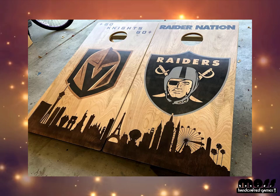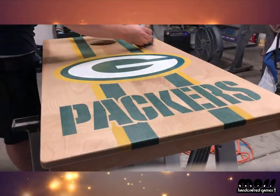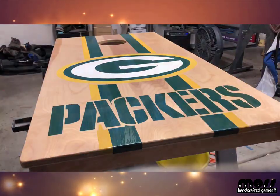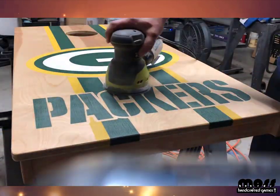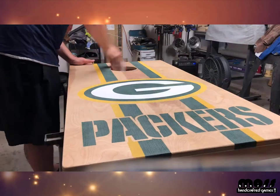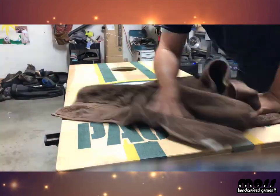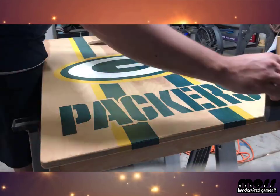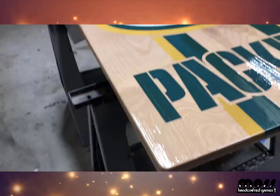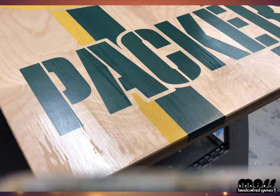Here's a start-to-finish recap: start with bare boards, spray them to lock in designs, apply the first few heavy coats letting them dry to the touch between each. Come back with your sander and 320 grit sandpaper after several hours. Don't forget to sand the inside of the hole and all the edges of the plywood, which are especially rough. Dust off, wipe off the dust, then come back for your last couple of coats and let the finish dry before touching the boards.